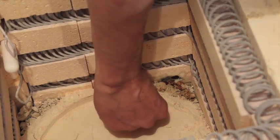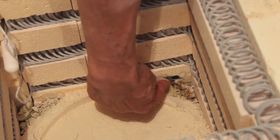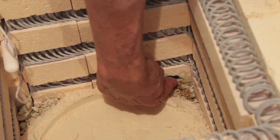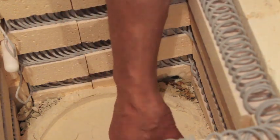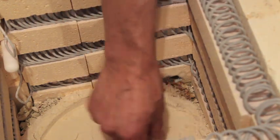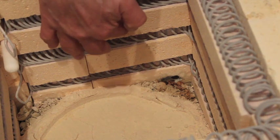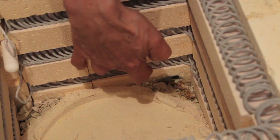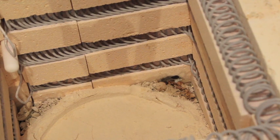There's the powdered grog in the bottom. You can see there's a little bit of erosion down there, not very much. I think I'll just pick that out with a screwdriver and put in the new pot and continue using it. The elements look to be in pretty good shape — I have the feeling I'll get another 20 or 30 cycles out of them, no problem. I'll just replace the pot and close it back up.